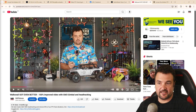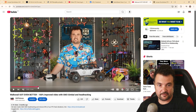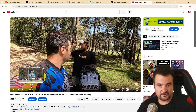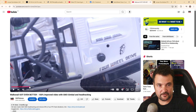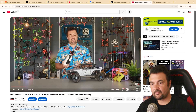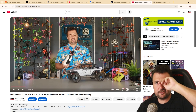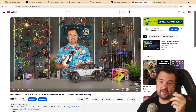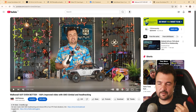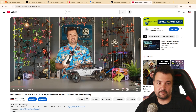...when we built this car right here — the DeLorean — it's not flying through the air all the time. Stick Man Steve had digital in it, and what he actually did is he got a little fan off Aliexpress. It had the same mounting holes and was powered off a five-volt BEC, or maybe it was three-point-something — a very, very low voltage little fan, but that was enough to run continuously so the VTX didn't get hot at all.